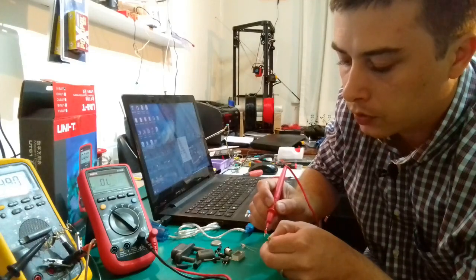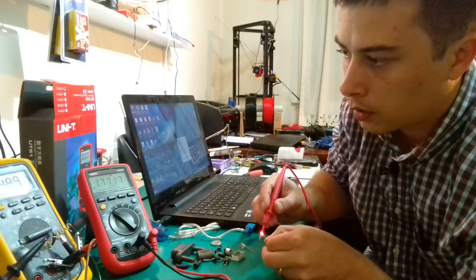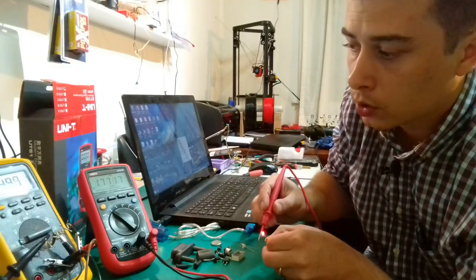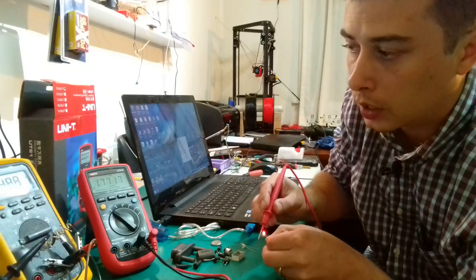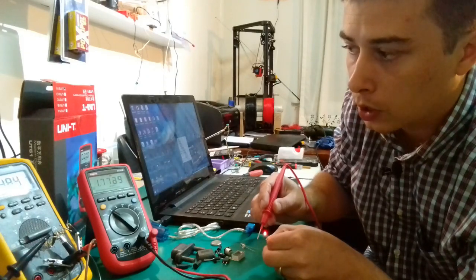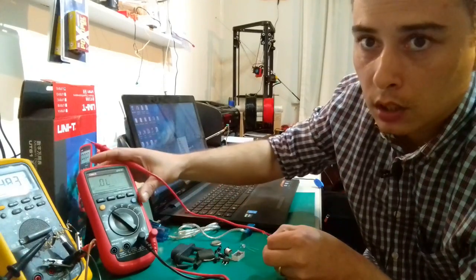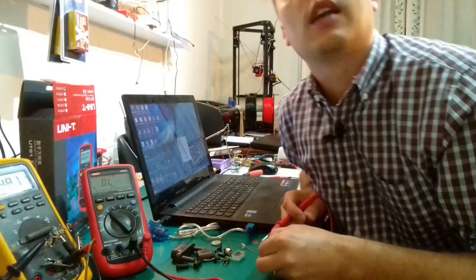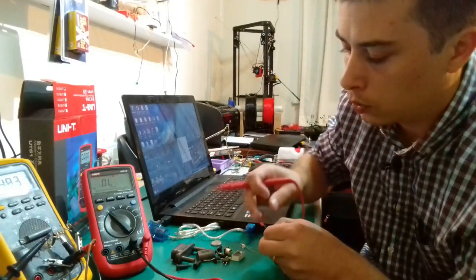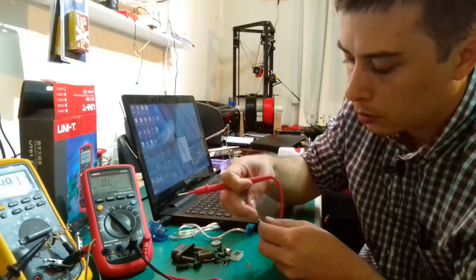See if this is displaying something on the screen. There you go. So it seems like if the LED's junction is opening up at 1.8 volts or something below 2 volts, I will get a reading on the screen. But if I have higher values, then it won't display anything. Let's come back to this one.